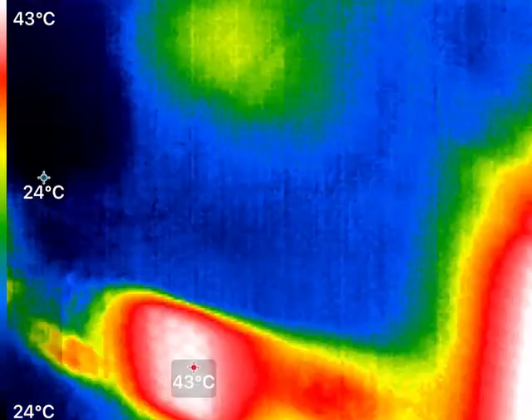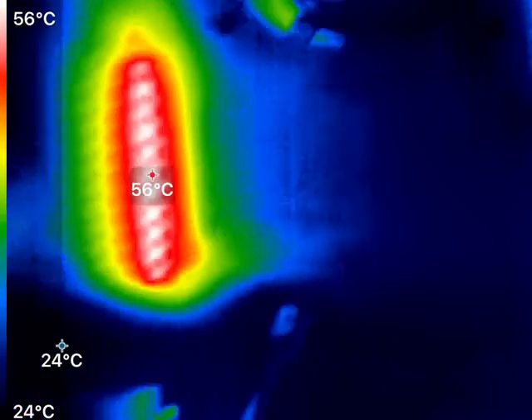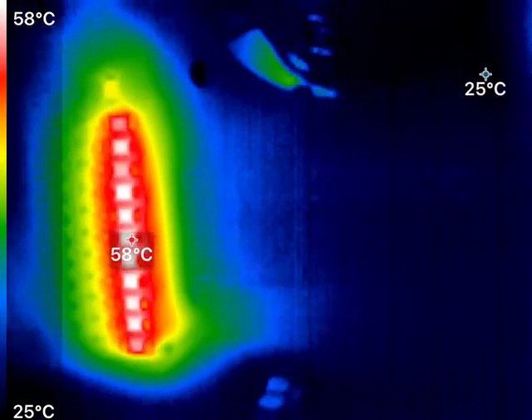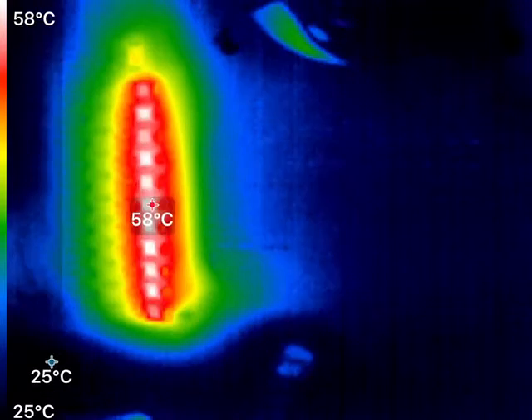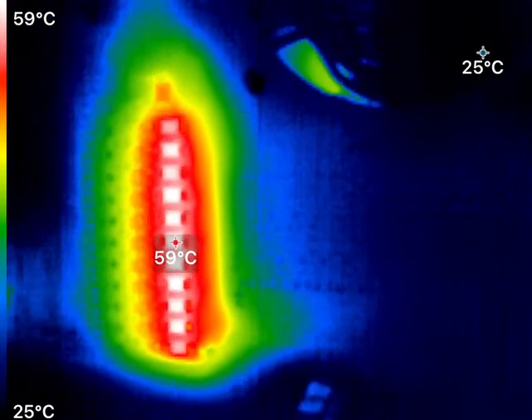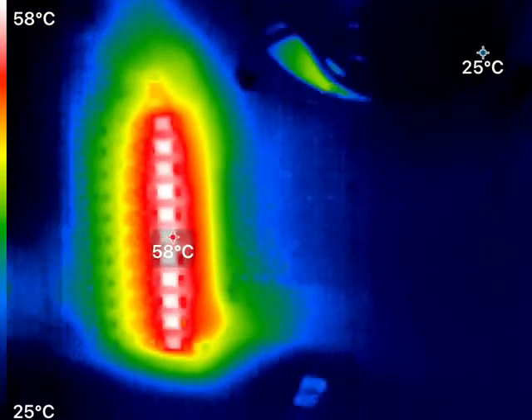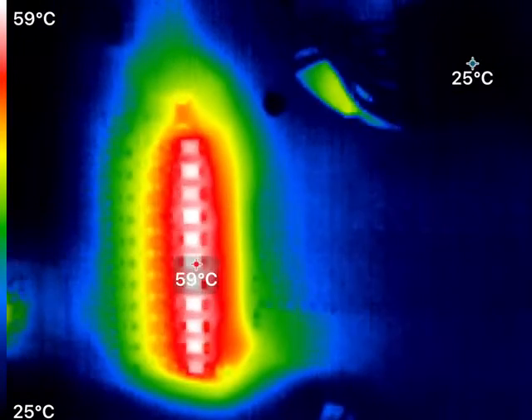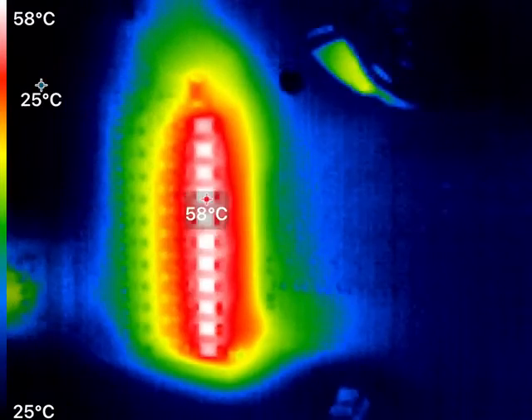I do already have a primitive check in here to make sure that the cell voltages are charged enough — the minimum cell voltage has to be more than 3.7 volts or something. And no cell can be above the maximum cell voltage of 3.9 volts or whatever. But I do need to make that a lot more robust before I pull that into main.